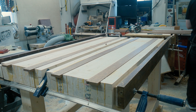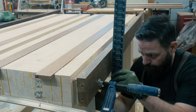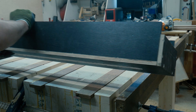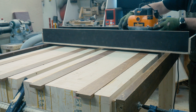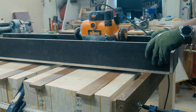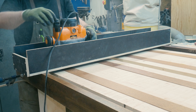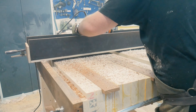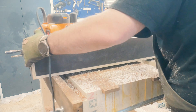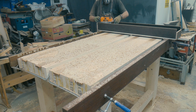I made the height of the inserts oversized on purpose, so I could use my router leveling jig that I made in part 4 of this series. The straight boards that I used as a level guide on the side of the workbench tops were still in the same place as in the last episode, so I fired up the router and took about 3 passes before the inserts and the tops were of the same height and level with each other.